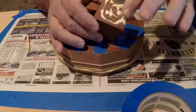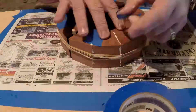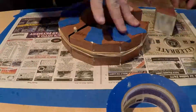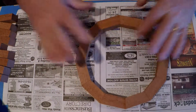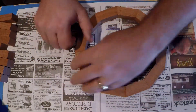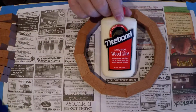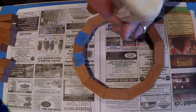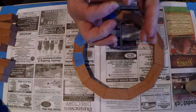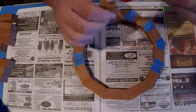Assembling the first ring, you can see how I missed my angle. A couple of short dowel rods provides enough separation between the pieces and creates a pivot point that compensates for an imperfect cut. Assembling the rings is a major undertaking. I apply glue to each angled side and secure them in place with a piece of painters tape. Holding the whole ring together with a few large rubber bands creates enough clamping pressure to the circumference so they are held tightly in place. The tape is really only there to prevent them from walking laterally to each other.